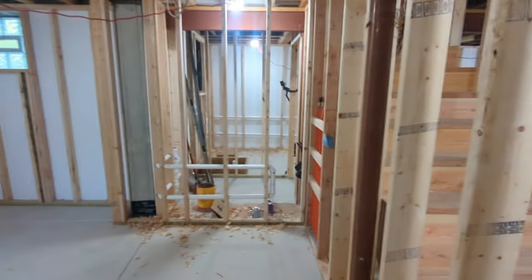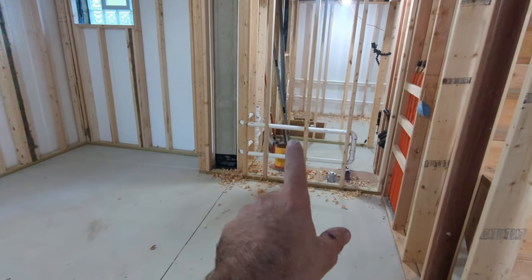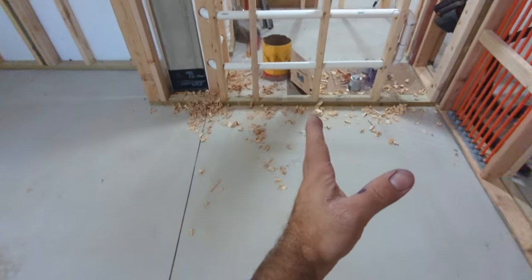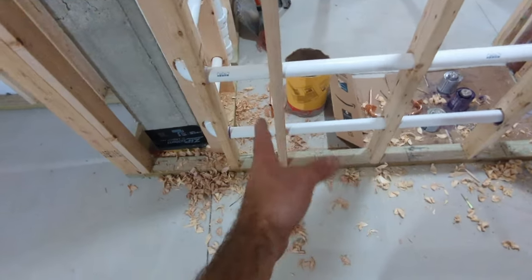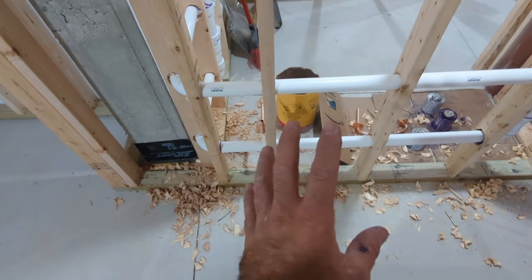I'll do something nice for his wife, but what am I getting at? I should put a drain and water supply somewhere on this wall. Now, if you're going to put kitchen cabinets down here, you have an inside corner. So something that faces you here, rather than being centered on this wall, is really centered in this two-thirds on the left. So we kind of need a drain in here somewhere and water supply. It can always be just left alone and never used.